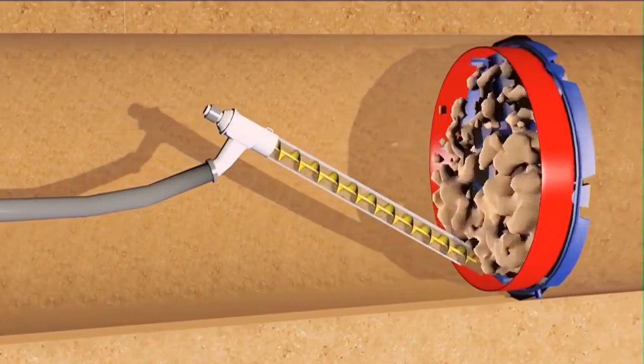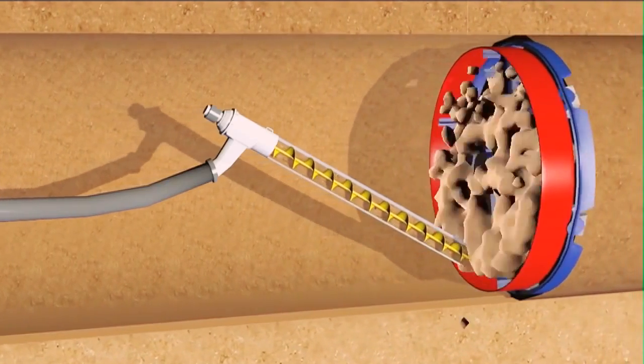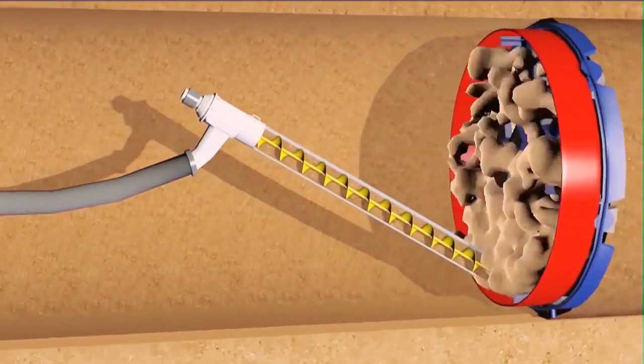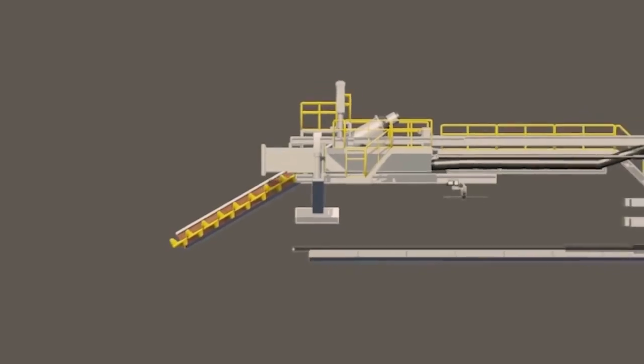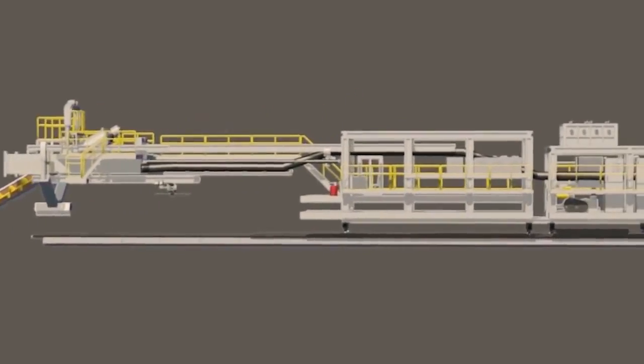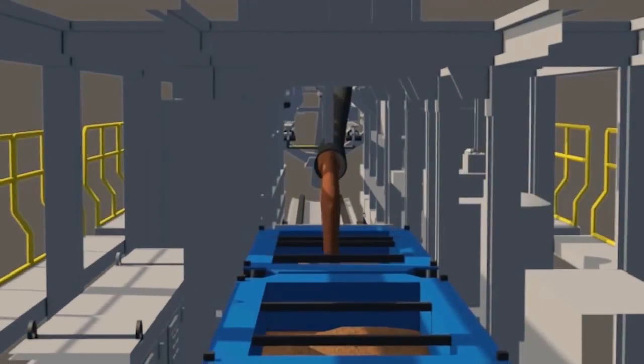The screw conveyor is used to deposit excavated material from the cutter head chamber onto the hose along the backup car. Soil disposal as a result of excavation will be transported from screw conveyor to hose system. The screw conveyor has one gate for muck disposal passed into the 14-inch hose. This hose will be ended at backup car number 1.